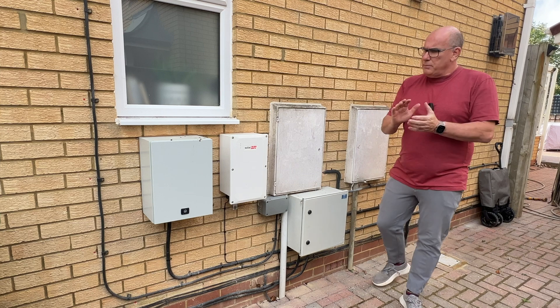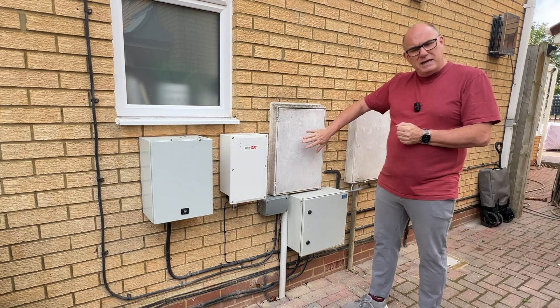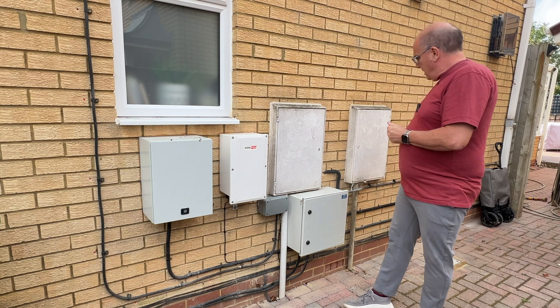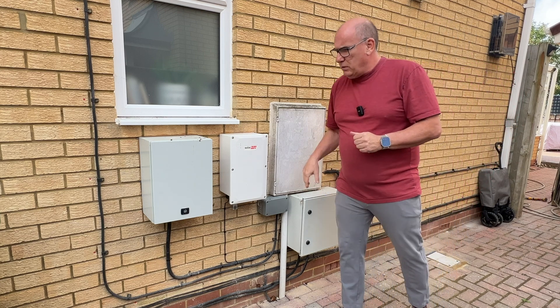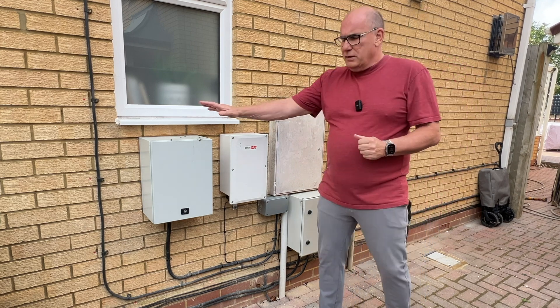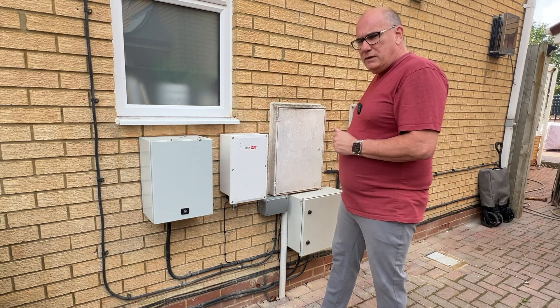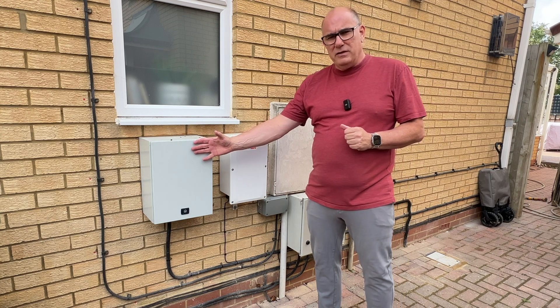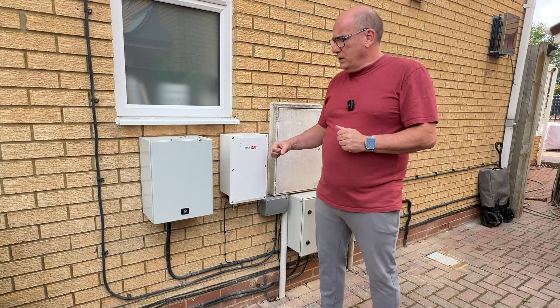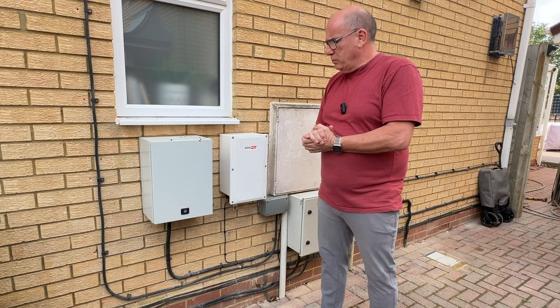Okay so here's the other part of the solution. This is our electricity cupboard — this is where the main supply comes in from the grid, and this is our gas. These two here are external switch units. This one supports my office. This one here is the main 60 amp breaker that allows the solar system to come in and feed into the house. This is a way of isolating the entire solar system from the rest of the house should we need to.